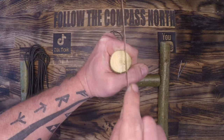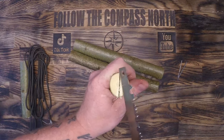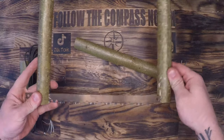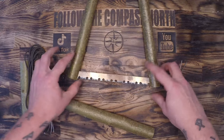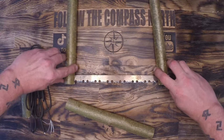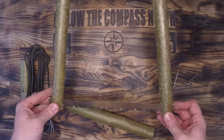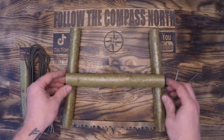We'll start off by using the blade to make a blade-width slot in the bottom of the two pieces of wood that make up your vertical supports. You should cut deep enough for that blade to recess completely so that your pins have some material to bite into. If you're too shallow on this it can rip right out the bottom. Typically buck saws are much larger and more robust than the model we're making, but we're making do with the saw blade that we have.